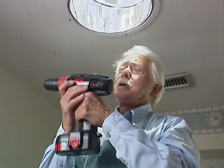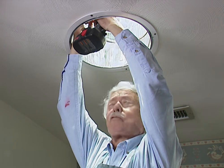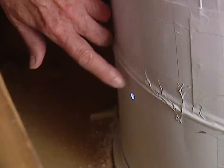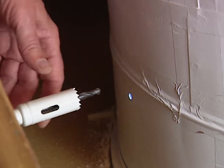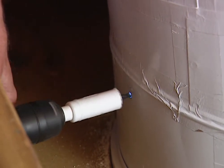Our next step is to drill our pilot hole up here. This is going to be a reference point so we can get up in the attic and drill a bigger hole for the wires to go through for our light fixture. We're going to be needing a bigger hole here for the wires to run through, so we're using a hole saw with the drill and it'll go right on through there.